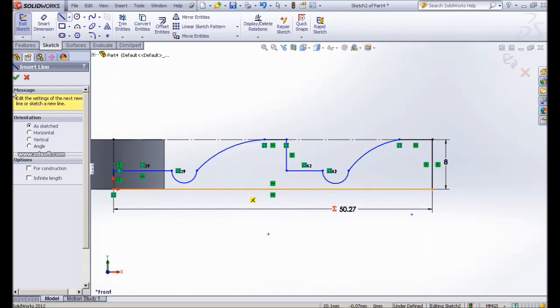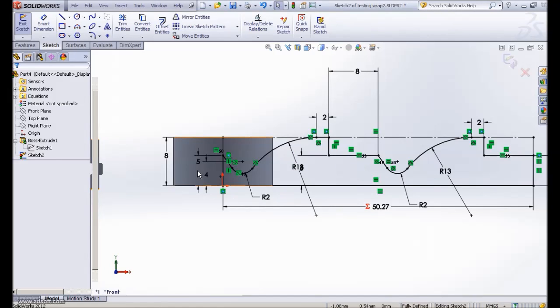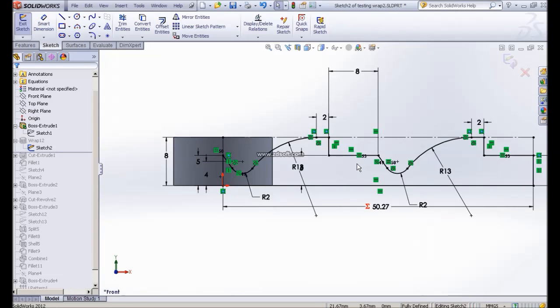You have a closed shape. The trickiest part is for you to set the constraints and put in dimensions, as shown in these images. We have a certain diameter, like the height here. But the way I've done it, I started differently. I started from the groove, the curve, step down, flat line, a groove. Then it's repeated this way.